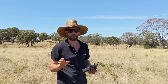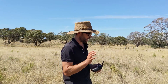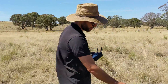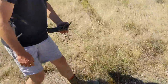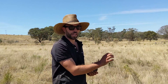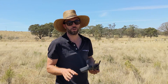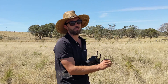One of the first things you want to do before you send your drone off to do mapping — and one of the most important things to get right at this stage — is your ground reference point, or calibration point. We've created an X here on the ground that we'll be able to see in the photos, and we've put a post in the ground so we can find it when we come back with the spray drone in a couple of days or weeks. This point allows us to calibrate our map so that our relative map becomes ground referenced. Extremely important — you won't be able to follow through on a fruit tree mission unless you get this right, and you need to get it right before you map.